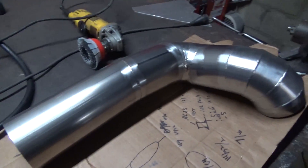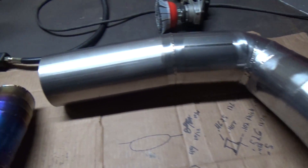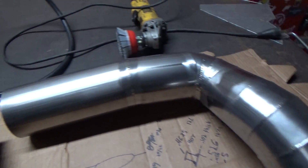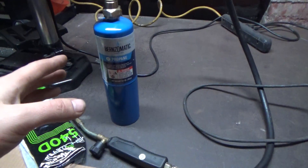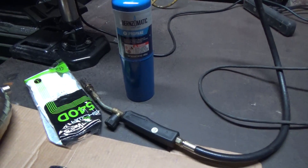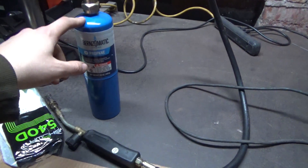Some of the things you'll need: obviously you'll need some sort of titanium work. This also works on anything that's made out of titanium, whether it be a knife, spoon, or plates — I've seen people color all sorts of titanium. Being this is an automotive-related channel, I assume it will be some sort of intake intercooler piping or an exhaust piece. You'll need your titanium piece and a clean pair of gloves. I'm going to recommend using propane — it's easier to control than oxy-acetylene, it's a colder heat, so it's more controllable, and it's pretty cheap. These little bottles are about four dollars.